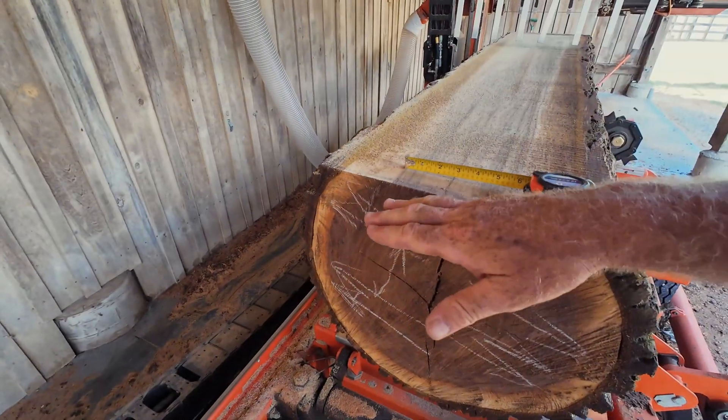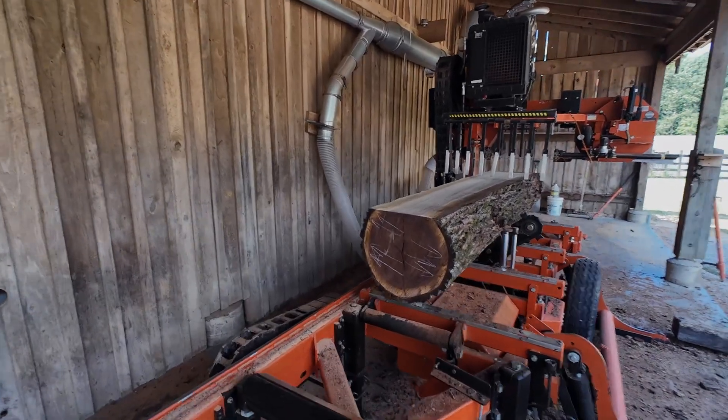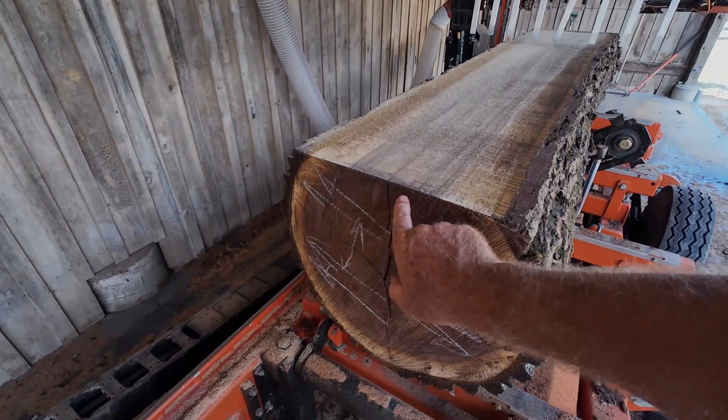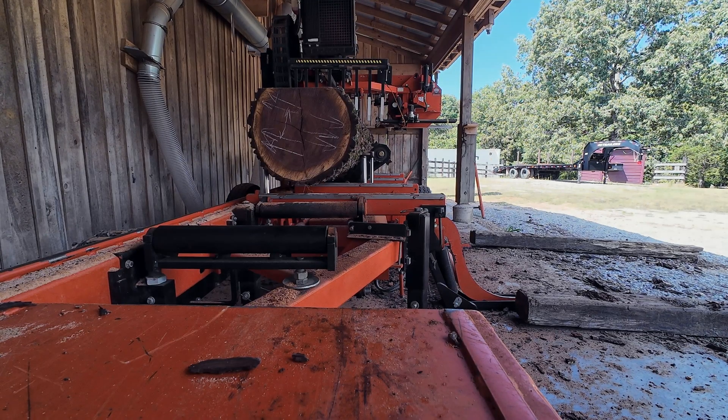The main thing is you saw how much the first board bowed up and the second board did not. That is just inherent stress in sapwood. You'll have a board that looks like a McDonald's arch, and you can sell that for extra money — when somebody says 'look at that McDonald's arch,' you say 'do you know how many years of sawmilling it took for me to learn how to cut a McDonald's arch out of a straight log?' So now I know that side has a lot of stress in the sapwood. Even though once I got into the heartwood, the stress was significantly reduced. That one behaved as predicted.